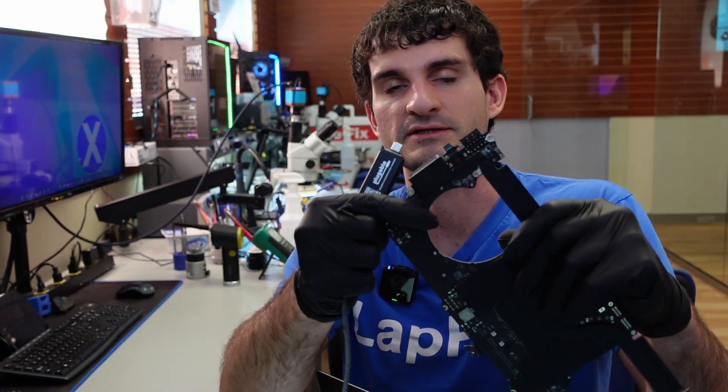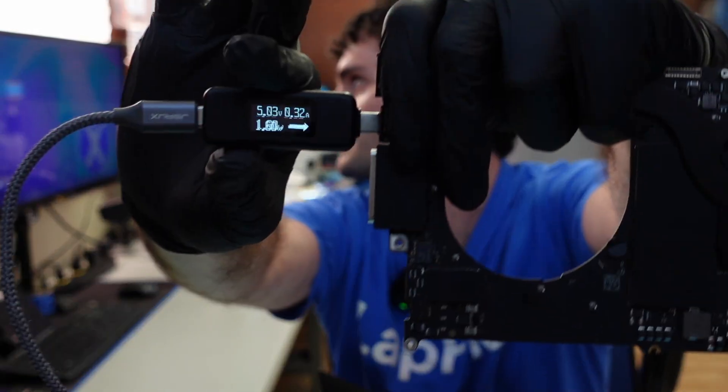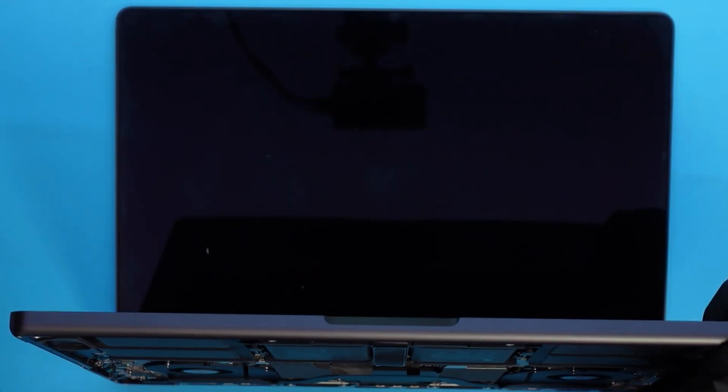Let's test it now by plugging in the USB-C port and seeing if we're getting a change in voltage. We were getting 5 volts, so we want to see if it gets to 20. Because we removed the short, it should get to 20 volts. Let's plug it in — we're getting our 5 volts and then we get our 20. The current is very low at about 0.1 — these Apple Silicon ones have a power-saving feature where until you press the power button it stays at very low current. We just need to plug everything back and power on. We should see the amps go up and see the MagSafe light with no problems. It looks good.